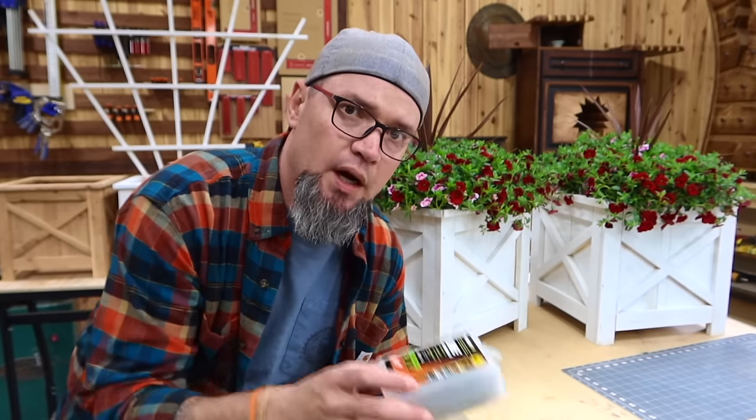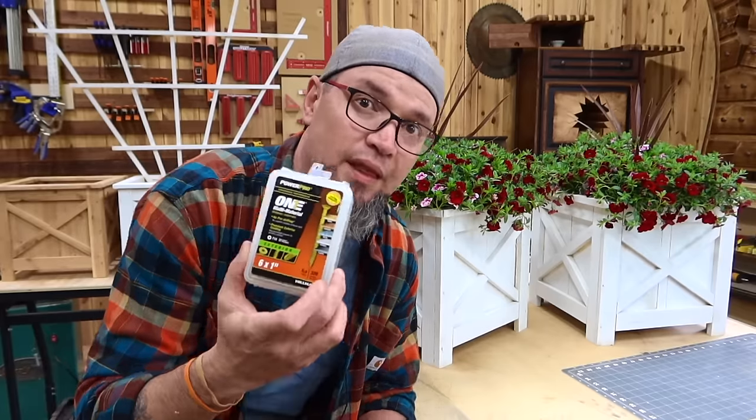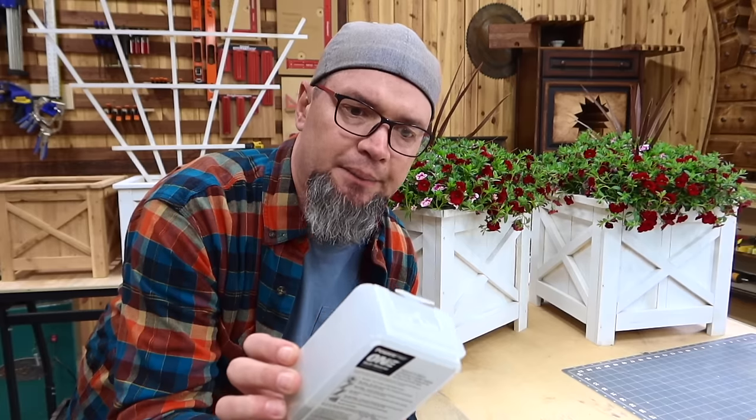In the last video, I got a lot of comments about the screws being too expensive — the inch and a quarter pocket hole screws. So this build is not a pocket joinery build. We are going to be using deck screws, specifically one inch. Your typical fence picket is five eighths inch thick, so we are using a one inch deck screw. They're harder to find — I'll try to link some. The issue is if you use a regular screw, they will rust and the treatment can actually break down the screw without the right coating. I actually purchased these at my local store — $10 for 320 screws, PowerPro brand.